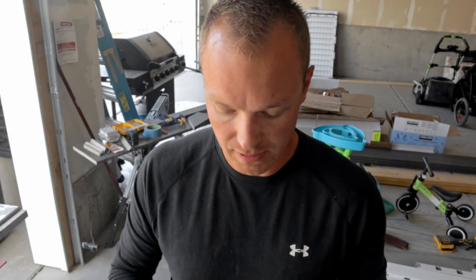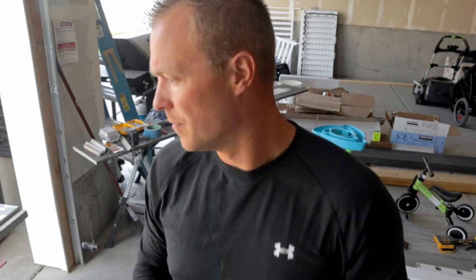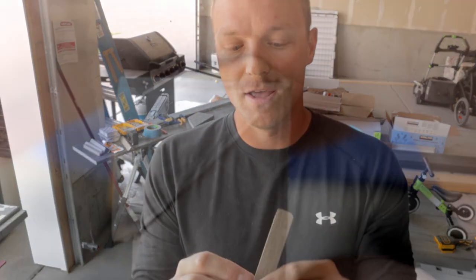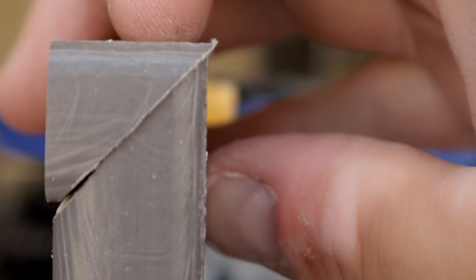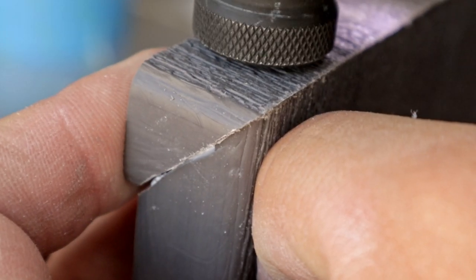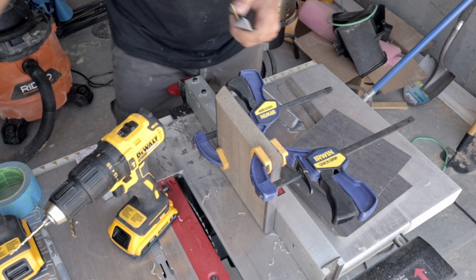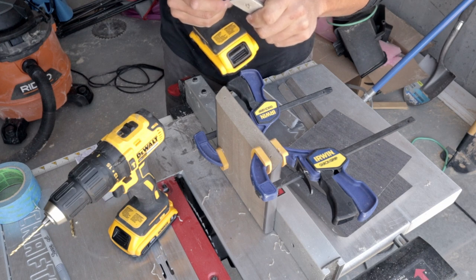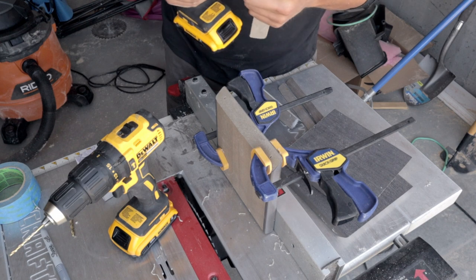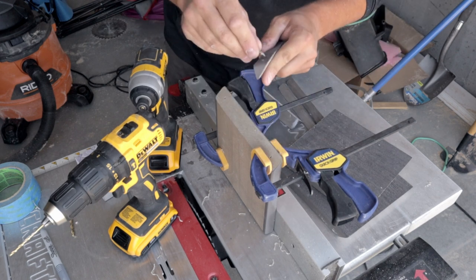Since I'm doing my fascia board with those decorative breaks, I'll show you how I make them. I take one piece and cut a 15-degree edge on one side and a 45-degree edge on the other on the table saw. I take another piece and cut a 45-degree edge on it, then cut it down on the chop saw. When connecting the two pieces you want that lip to hang out just over the top, because when I drill the holes and screw through the top it's going to cinch it down, slide it down that board, and give us a good tight corner. I'm using GRK fasteners with a smaller head, and I screw it in a couple of times to see if there's composite pushing out — I want to clear as much of that out as possible because it'll push in between the two boards when screwing and end up separating them.